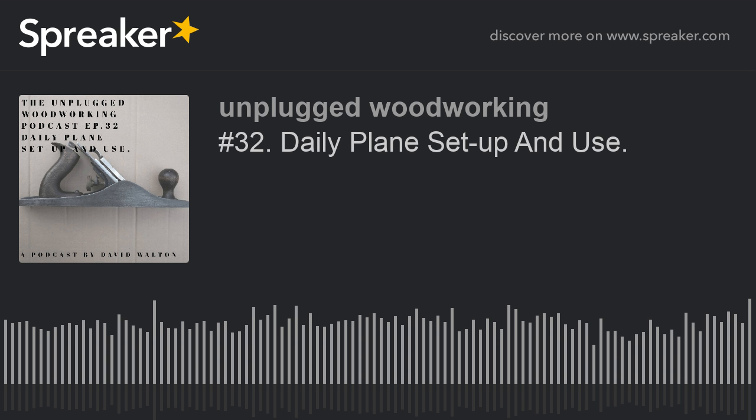So to correct this is what I'll do. Whichever side's the highest side, I'll attack that side first. So, same again, if we're using a 20mm piece of oak, just for argument's sake, that's the thickness of it. So the side that's higher, I'll only attack that side, so it might only be half. So the way this works is that if you look on the bottom of the sole, it's got its mouth, and at either side of the mouth, you've got, I'm not really sure what it is, about 3 or 4 millimeters at either side, and that's connecting the whole sole together, and then obviously you've got your mouth in between that.